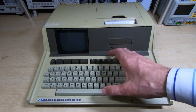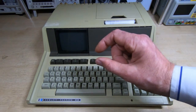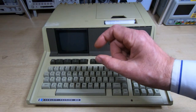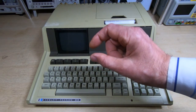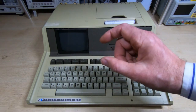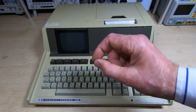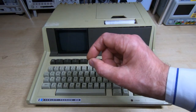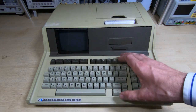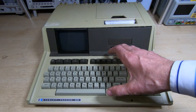Because I was making a real-time system I had to use an interrupt to read the key. When the interrupt first occurs it's triggered by the closure of the key toggling one of the pins. But when the processor goes back to look at the key, it might have already bounced open, or if the delay is too short, it sees the bounces as separate key presses. So you have a debounce — a dead period — where when the key is first detected as pressed, there's a delay before the processor rechecks it. If that delay is too long the user might have released the key; if it's too short it might still be in the bounce period and you'll get flaky behavior.